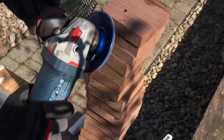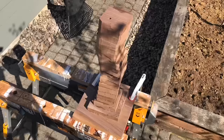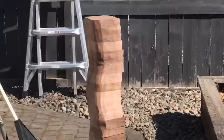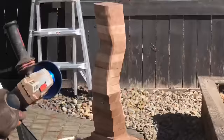This is an extreme cut saw wheel, and it is basically just tungsten little teeth on an angle grinder, so you need to be really, really careful when you're using this. I used gloves at a couple points — when that blade was slowing down, it touched my glove and ripped a big hole in it — so it would be really, really bad to have that touch your flesh. Use this with extreme caution, because that will do a ton of damage to flesh if it comes anywhere near you.